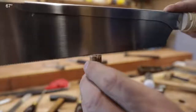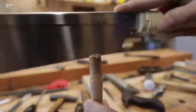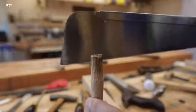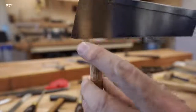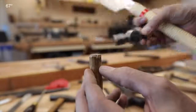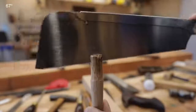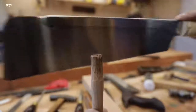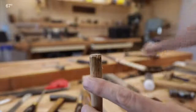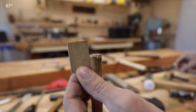The question is how far down do you go. As a rule of thumb, don't go any less than half the thickness of the head. I like to go a little further — even three quarters — because if you don't go deep enough, your wedge will bottom out. This saw is actually great because it has hardly any set, so it's making a very small kerf. Make sure you understand exactly how far you went down and, if your wedge is ready, mark it.